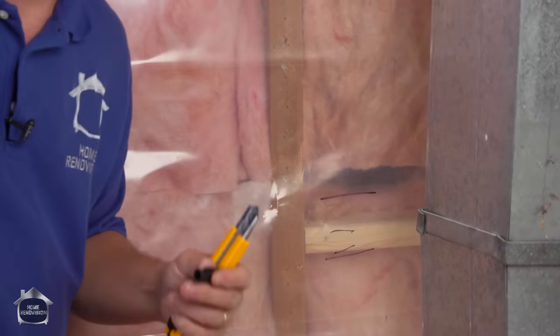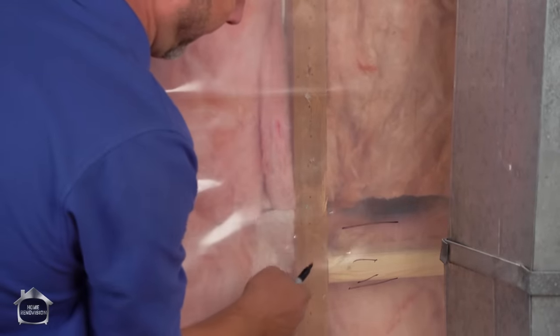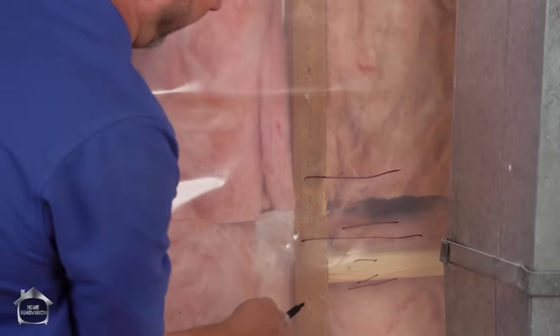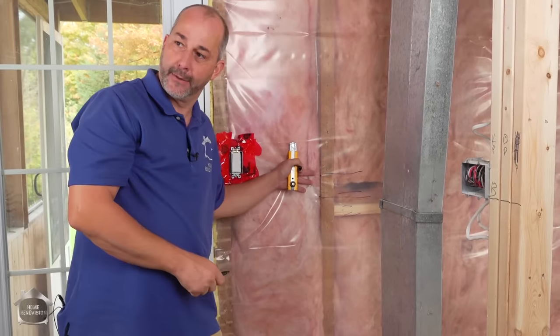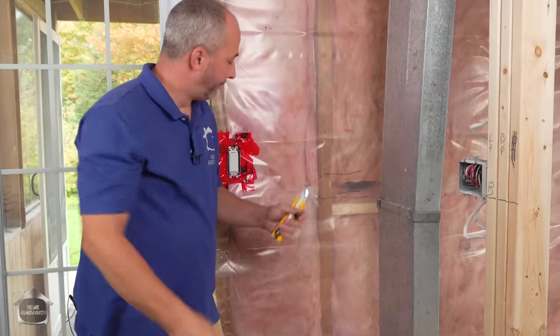So Matt, what we're gonna get you to do is pull the blocking, set it where the insulation joints are, okay? And then we're gonna go on the wide side where the insulation joint is. You pull the plastic and you can throw your screws right here on an angle and you can actually screw right through into that board, okay? It's really easy to install. You can set these screws before you put the board there.